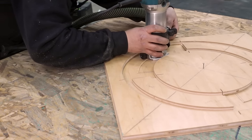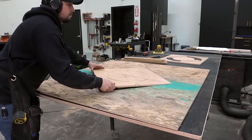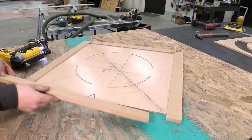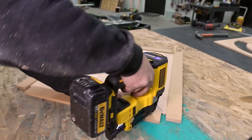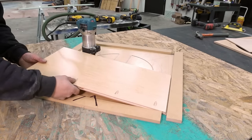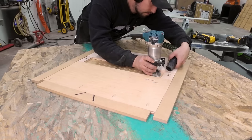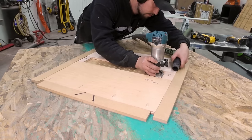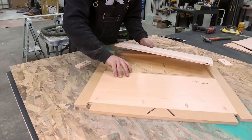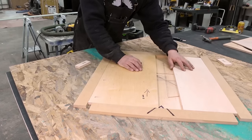The pin can be pulled and the arc jig spun into position two to cut the other two corners. With all four arcs done, it's time to create the straight cuts. With the base panel temporarily raised up, I can mount an outer frame that will contain the straight panels that will produce the rest of the pattern. These are two different panels that create an off-centered track for the router. One stop at the beginning and one stop at the end will serve as stops for the cutting process so I don't go too far.